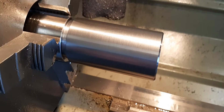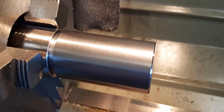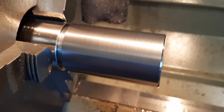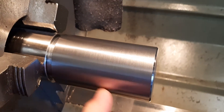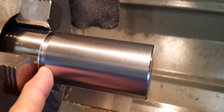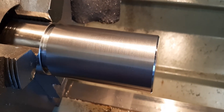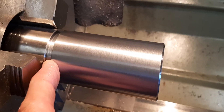I've got it held pretty close up on the lathe chuck. Even though the size of the bar, you still do get chatter — believe it or not. You wouldn't think you would with that dense a material, but it does chatter. I think it's probably more so because of the material and the profile of the tool when you're cutting 60 degree threads — in this case the 4.5 TPI UNC thread, which is a standard 2 inch thread. I tried holding it a little further out from the chuck and it started getting chatter, so I had to reset, set up my tool again, and choke it right up as much as I can.